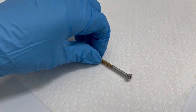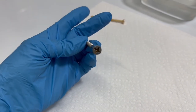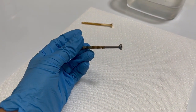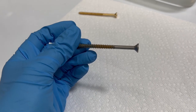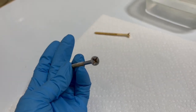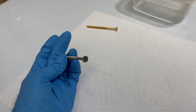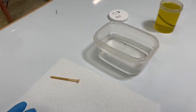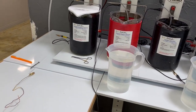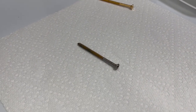So I want to show you this screw. This is one that we went through the process of removing the zinc plating. We thought we'd get ahead of it and just strip all the zinc off first and then begin the plating process. As you can see, there is already rust building up in those threads and in the head. It's very important that when you go to plate onto these parts, you're able to go straight from the hydrochloric acid into some distilled water and then begin your electroclean. These parts started to rust within just minutes of sitting out and oxidizing.